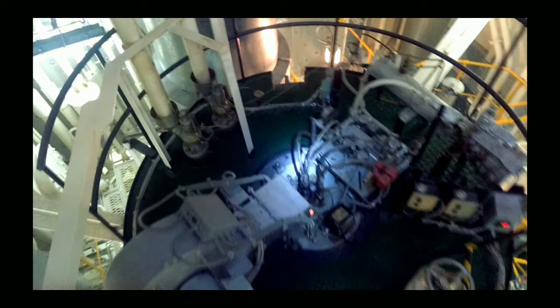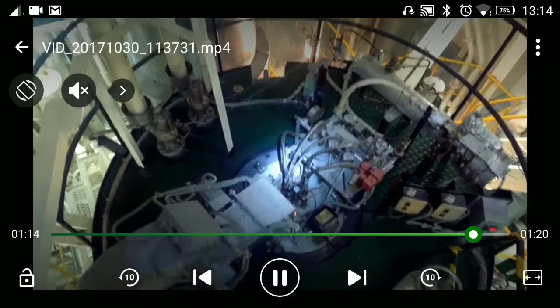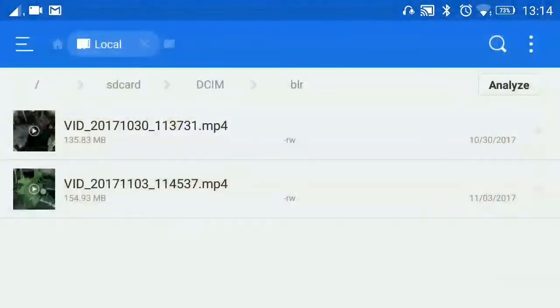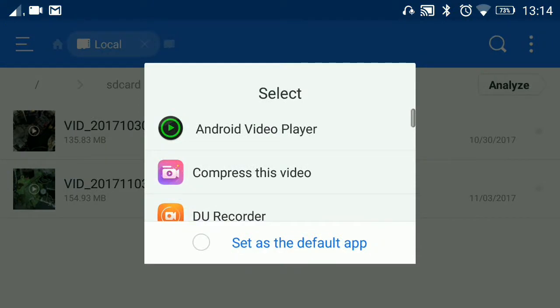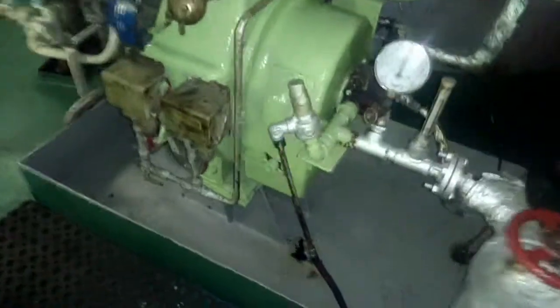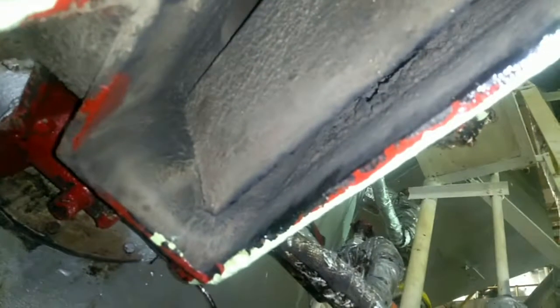Inside the pipe the burner is separate. On other boilers it will look completely separate. This is a top-fire boiler — I'll also show you the side-fire. You can see the damper or flap indicator here. Inside is the damper; you can see the rod. The damper, or flap as you can call it, is currently about 30–40 percent open since firing is going on.